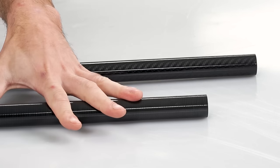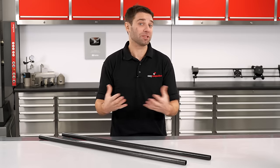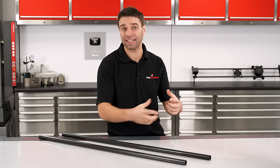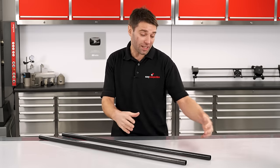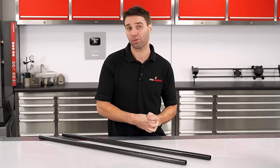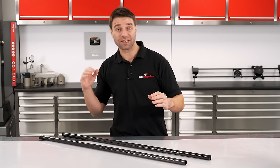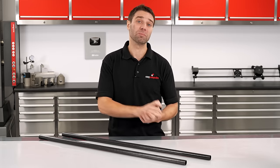Stock roll wrap tubes will nearly always have this 0 and 90 degree fiber orientation but the roll wrapping process does allow you to do absolutely any fiber orientation at all — whether that's setting out the fibers helically to give you better torsional performance for something like a prop shaft, or adding more in the hoop direction to make it able to withstand more internal pressure. In theory you could even run entirely unidirectionally like a Pultrusion, but generally the Pultrusion process would be more cost effective.